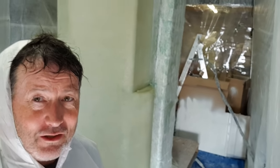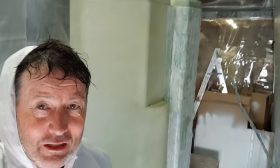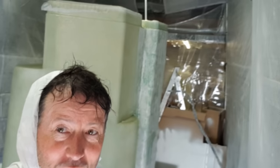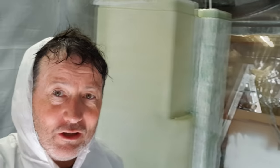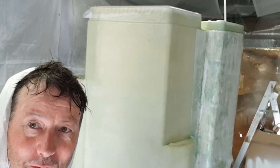So we're not chopping the resin and the glass on. We're actually laying it on in cloth so that way we're getting a nice measured quantity. And we're getting this really superb finish with about a quarter of the effort. So you can see over here, that's not quite wet, and in a second it will be. So I'm going to get my mask back on.